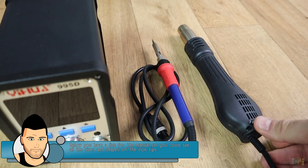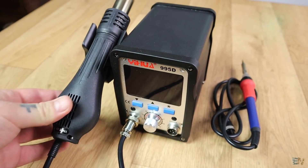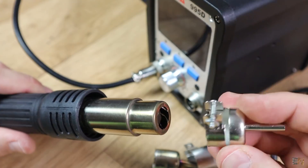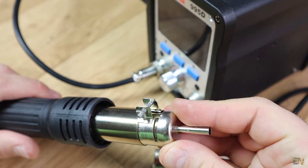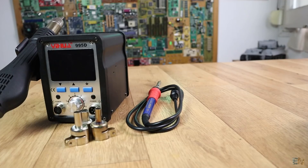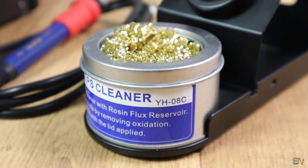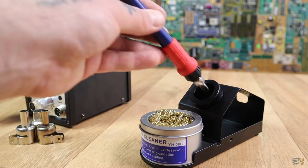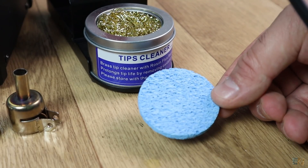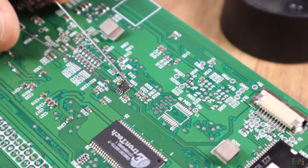Next is the hot air gun, which plugs into the main case just like the soldering iron. We have a bag of different sizes and shapes of tips for the hot air gun — just plug the tip into position, tighten the screw, and you're good to go. Finally we have the soldering iron base with cleaning brass sponges for cleaning the tips, with flux inside, as well as a wet blue sponge circle for tip cleaning.